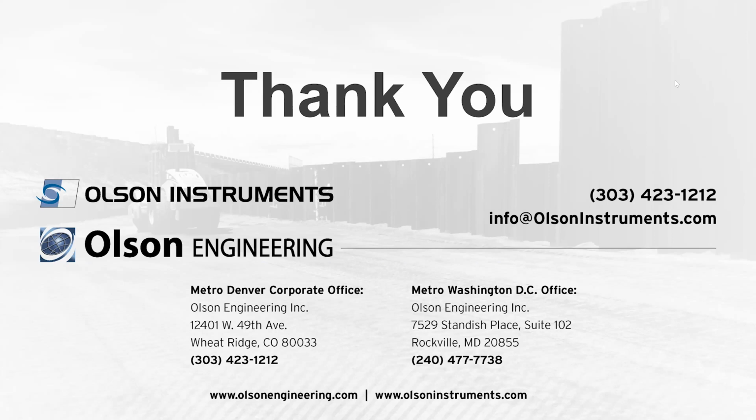And certainly to emphasize it again, a number of researchers, subsequent students of Mike Mooney's, Chris Senseney, and others at Colorado School of Mines and University of Maryland are all pretty confident you're better off measuring force. You get a more accurate result than just saying you know the drop height and you know the weight, so you know the impact force. That varies depending on what's springing back at you. Soft soils, it will be low. Stiff soils, it will be high.